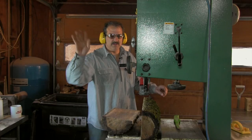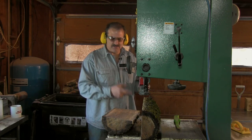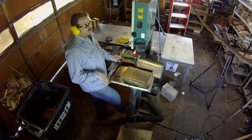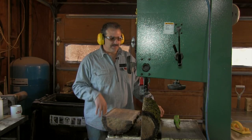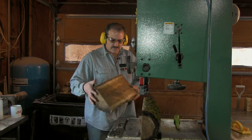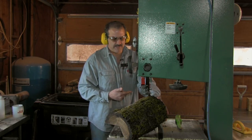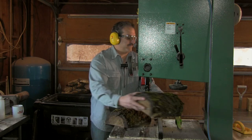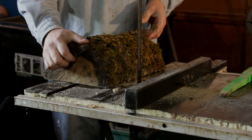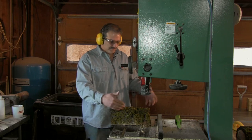Before you move this kind of wood, unless it's fallen off the end, you want to shut your blade off. These are heavy pieces and your mind is on the piece, not on the moving blade. So make sure your blade has stopped. Some band saws have brakes located right here — use your brake to stop that blade so you can move your blocks of wood safely. These are about 15 pounds a piece, and when you're moving this kind of stuff with your blade moving, there are too many things that can go wrong. Now you have a flat spot where we can make a horizontal cut on the half round, and that's safer because it's fully supported on the table.